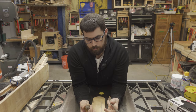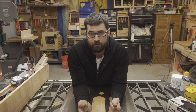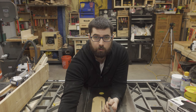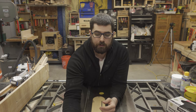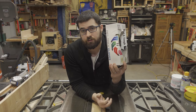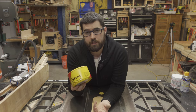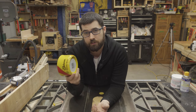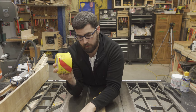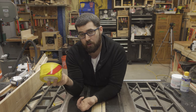You don't need much in the way of tools to perform routine maintenance on a table saw. Some of these are very specific to your table saw, but mine requires a Phillips head screwdriver to remove the throat plate, the arbor nut wrench, and nitrile gloves so I don't get grease all over my hands. Some Johnson's paste wax — you can use any paste finishing wax, but I prefer the Johnson's. It goes on, dries, and leaves a nice filmy haze so you can tell when it's fully dry and ready to buff out.